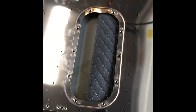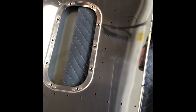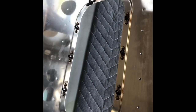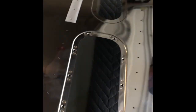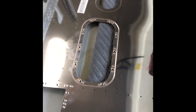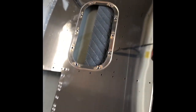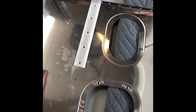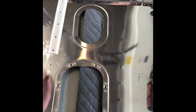That was a royal pain in the butt. What we just did was rivet on the nut plates. First we dimpled all the number 30 and number 40 holes along the access panel holes and the edge right here, and then we riveted the nut plates onto the access panel holes on the left and the right. These will be for the floorboard baggage compartment. We also put on these strips which the fuel tank will sit on, to prevent the fuel tank from rubbing on the aluminum and damaging the floorboard or the fuel tank.